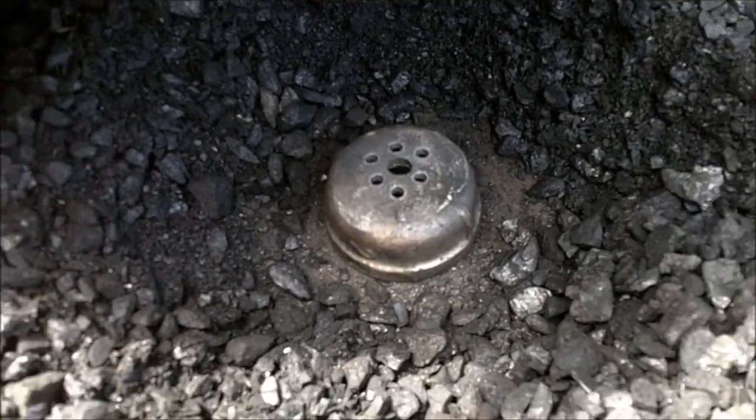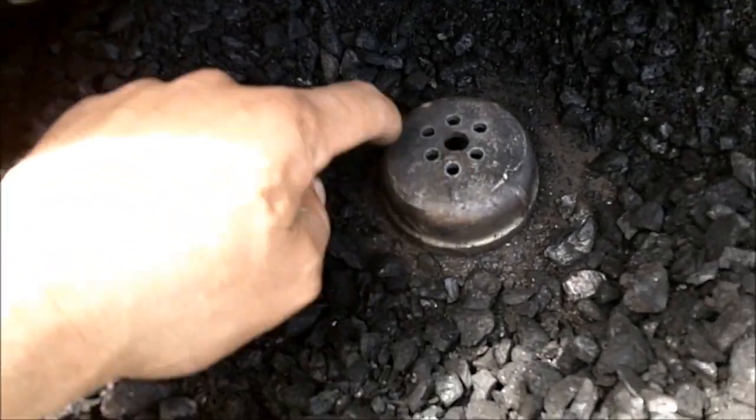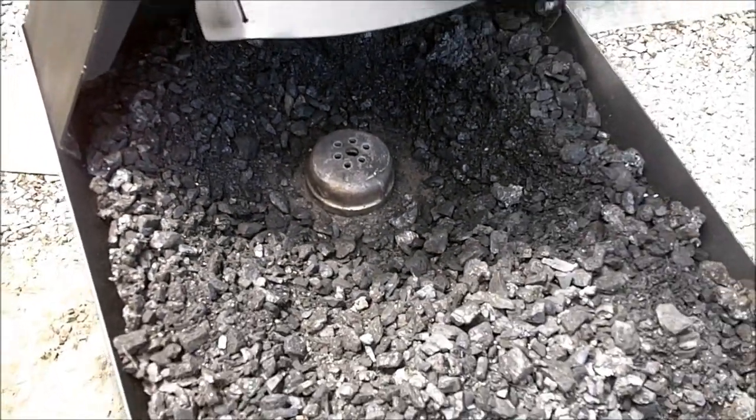On this forge I wanted a little more air because I want a bigger fire. So I've got my 7/16th hole and a bunch of quarter-inch holes around it — six quarter-inch holes. I think that ought to work pretty good.